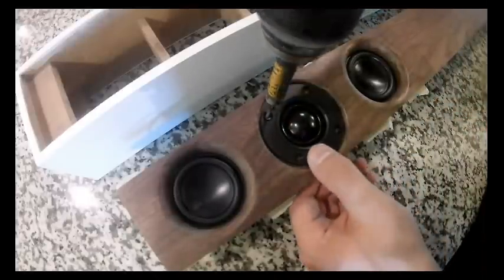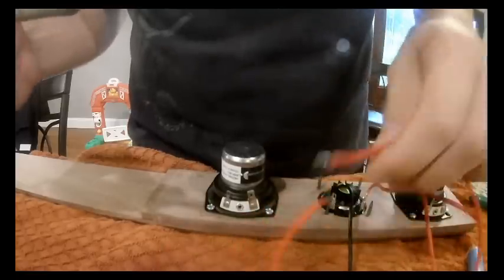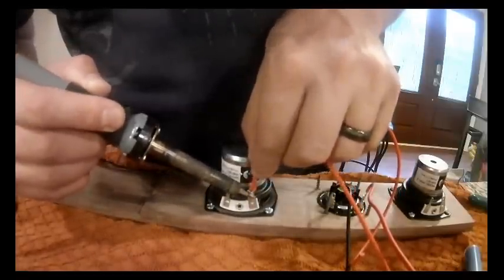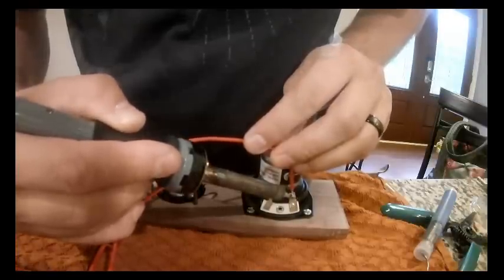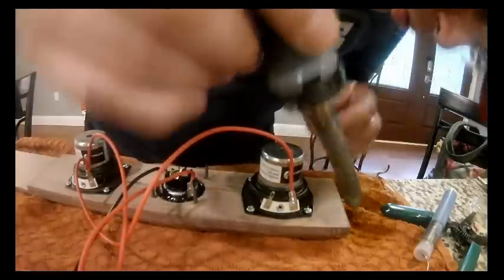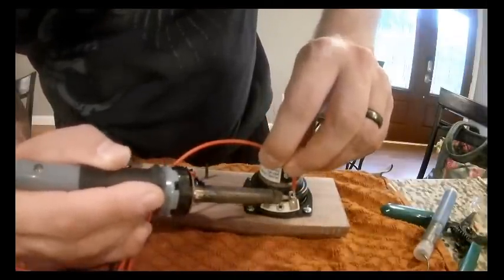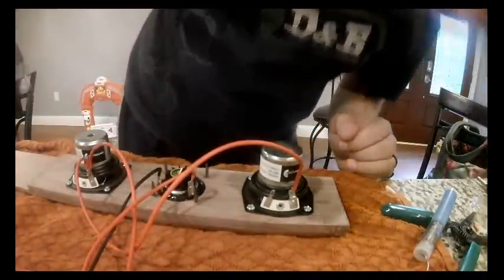With the tweeter it's not as hard because you can line it up from above while looking at it. Once that's done, solder wires to the speakers. The tweeter is soldered just like normal — one positive and one negative. The woofers are wired in parallel, which drops the 8 ohm load to 4 ohms. That means the positives are connected to each other and the negatives are connected to each other, with one line going out into the cavity where the crossover is, connecting to the crossover section.